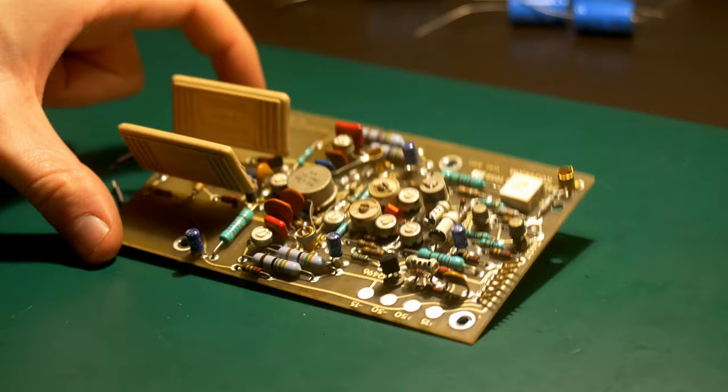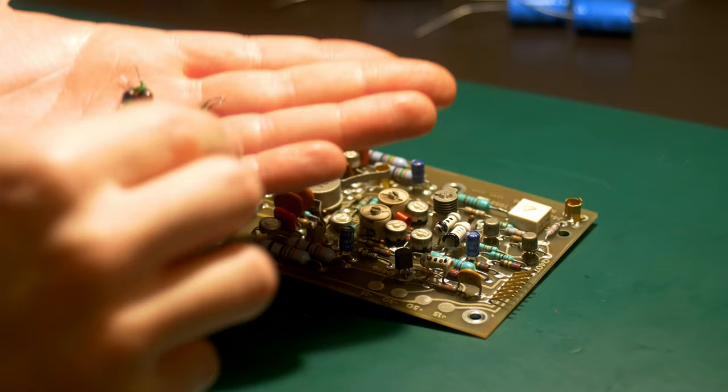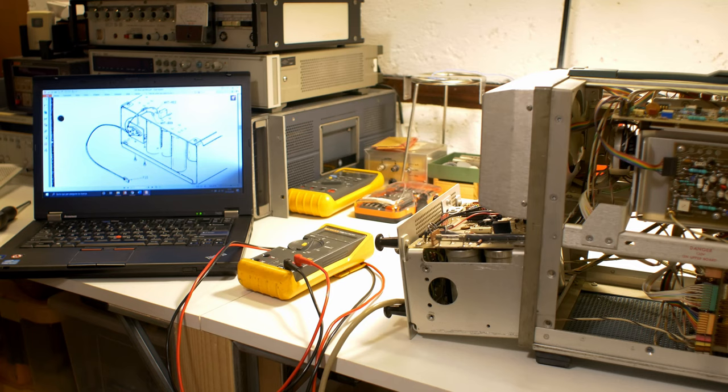All right, so I changed all the caps. Those are the 4 caps. And those are the little bastards. Look at those. All right, so what I'm going to do now is modify this oscilloscope and add the pushbutton illumination mod, which is very famous because those 7600 series oscilloscopes don't have the 5 volts required to run the little light bulbs on the plugins.